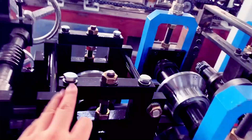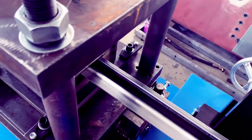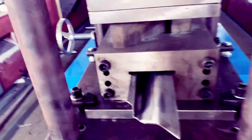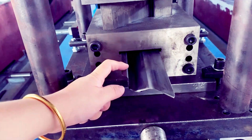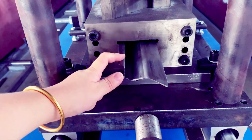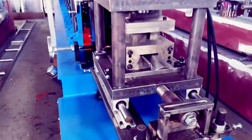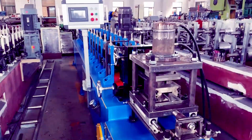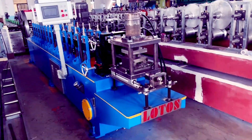Here's the Turkish head to adjust the profile, and this is the cutting cylinder. We can see from the die — after cutting we will get the finished product with 45 degrees. With this angle it can be easily joined to be a door frame or even a window frame.